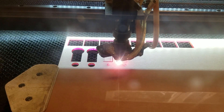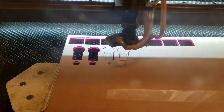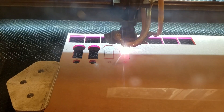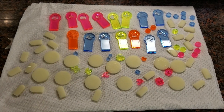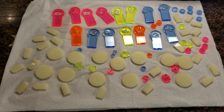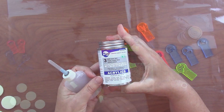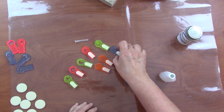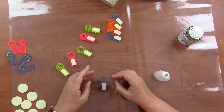Here is the pink or red fluorescent acrylic. These are 3/16 inch thick acrylic, and I cut two sets because the first set I had to make some adjustments to the symbol and recut them. I leave the paper on both sides to protect them from the laser smoke, and then I soak them in Simple Green to make it easy to remove the paper. Here's what the parts look like after the paper's been removed and they're cleaned and drying. Now I need to assemble the markers, and I do that with this weld-on solvent cement in an applicator bottle. The engraved lines make it easy to see where to put the solvent, and by the time you've done 10 you can move on to the next part.